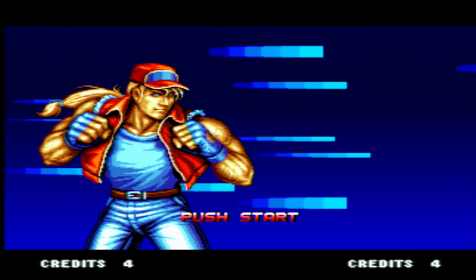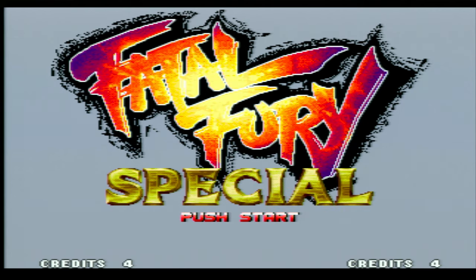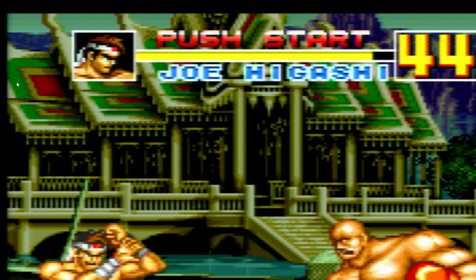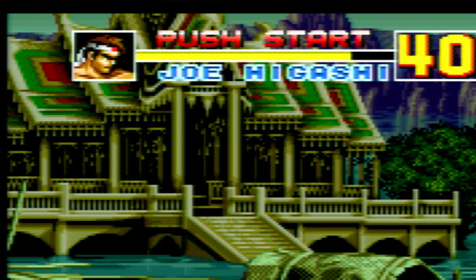We've obviously got to fix the voltage levels on this board like the other one. Let's just zoom right into that. And yeah, even zoomed in, you can't see noise. So I'd say there's probably still a little bit of room for improvement, but that now is very close to clean. So you can see the jail bars have now gone completely, and I think we're left with a checkerboard pattern.